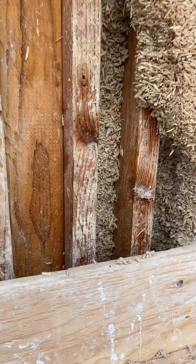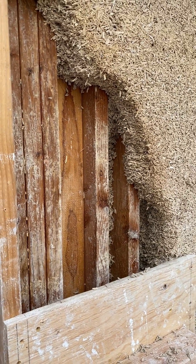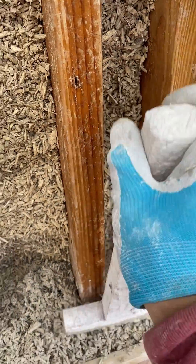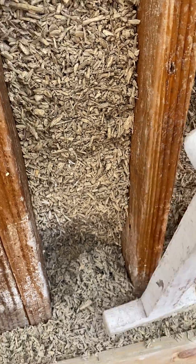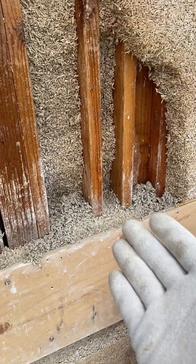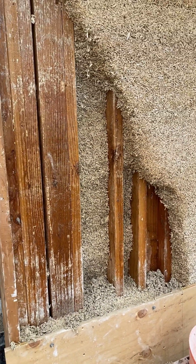And that's the way to heal your holes where the material has not been compacted well — basically getting to the top, tamping it down really hard so it's nice and firm. Then we shift the formwork upwards and go all the way to the top. Yesterday I showed you how to carve out the loose hemp if there is any inside your wall partitions. You want to avoid that at any cost, but sometimes it's poorly packed. Now it's really hard — it's drying up pretty well.